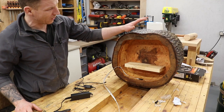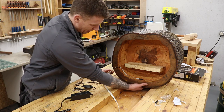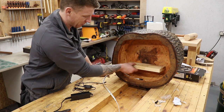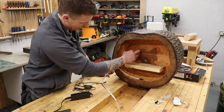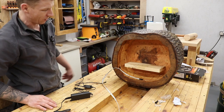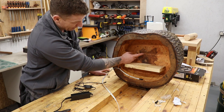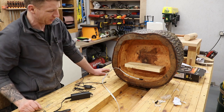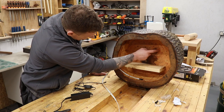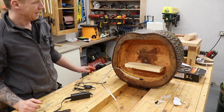This is where we're at — I have it all oiled with boiled linseed now, even the bark on the outside just to help preserve it a bit. I've drilled a hole through to take the power lead for the LED strip, which will just hang outside. The little shelf is mounted up — this is the spalted beech shelf and I like the contrast with the white and the orange. You can see this pattern in the tree — this is the ash dieback disease that's killing ash trees all across the northern hemisphere. It rots the tree from the inside out, all the way up through the tree and out through the boughs, and that's eventually what brought this tree down in the storm. But it's actually a nice pattern in the wood. I also decided to leave the little holes from the tip of the auger bit just to give it a kind of pattern — it looks interesting and it's all experimentation.